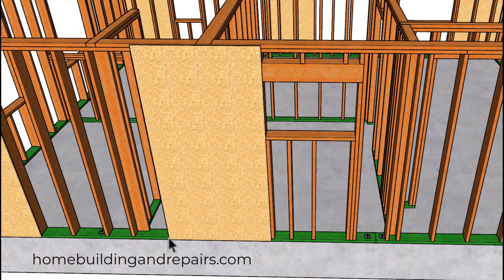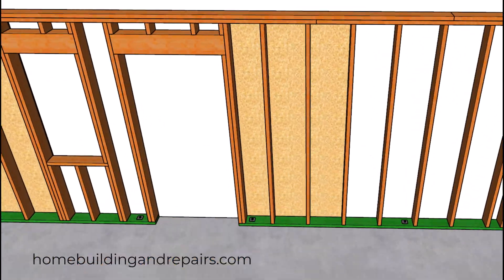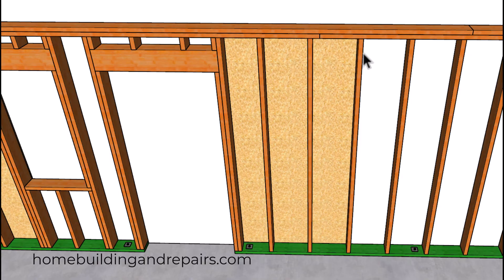Here's a good example of where the shear panel will need a stud over here and a stud over here. I went ahead and made these full-length trimmers because of this shear panel, but I don't know if that's something you would need to do. You can see here where we have the stud, and this break would need to come over to here — so make sure you don't do this right here.